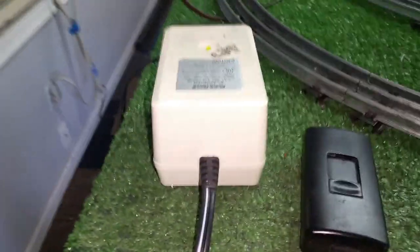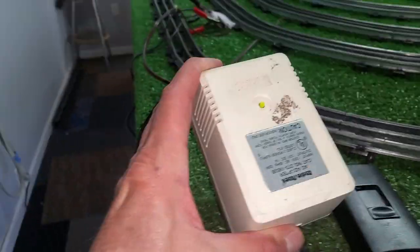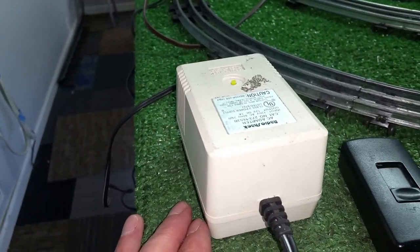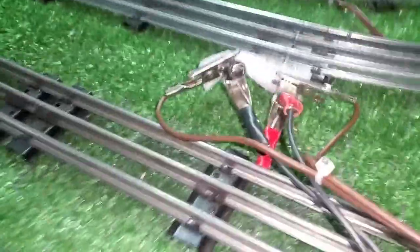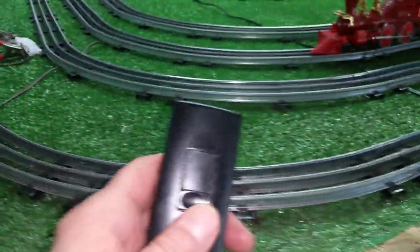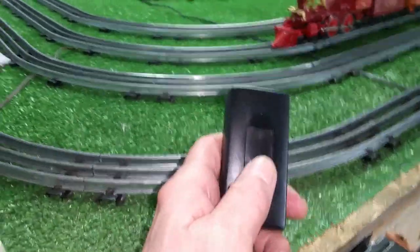The easy way to do it is like this. This is an old RadioShack 12-volt DC transformer — this is what I use for running that electric whistle. And I've just connected it to a magnetic lock-on, and then plugged the transformer into a standard lamp dimmer. So you vary the input voltage to the transformer.